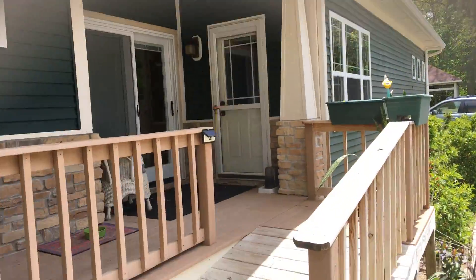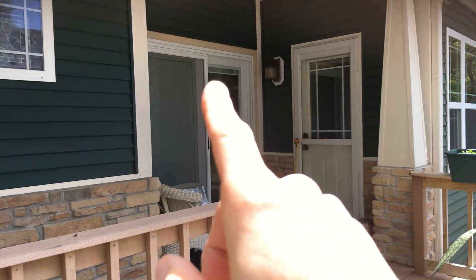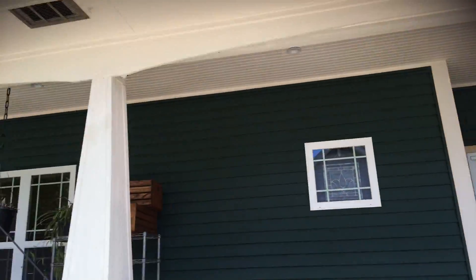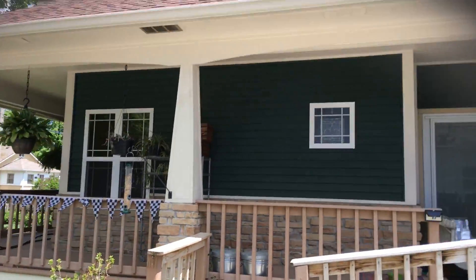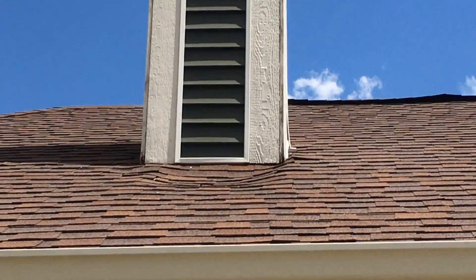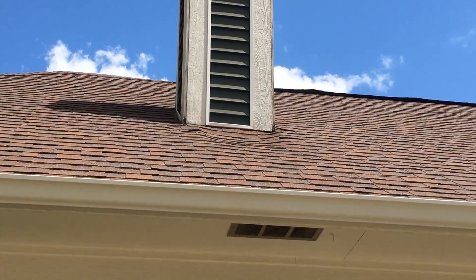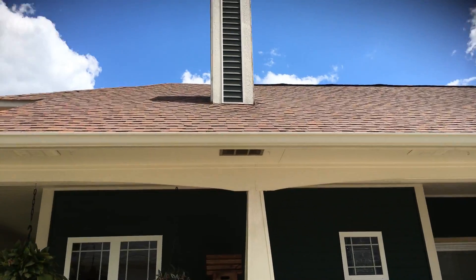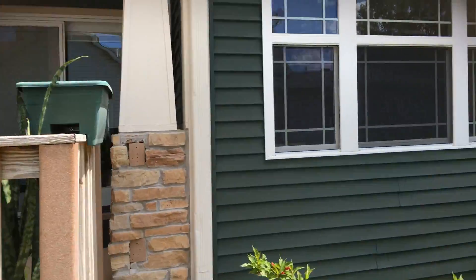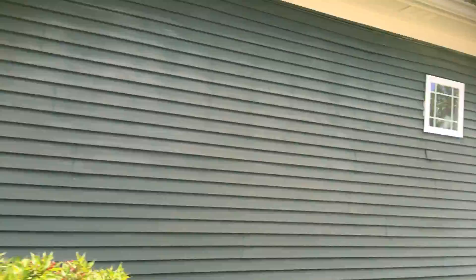Back here, the only thing on the doors that needs to be painted would be the inner door — not the storm door and not the slider; leave those alone. Up here at the chimney, there are a couple of boards at the bottom we need to pay attention to. They're not bad, but we need to prep them to make sure moisture won't cause future swelling or rot. You've also got trim boards behind the gutters and downspouts — we'd include the gutters and downspouts in the scope of work.